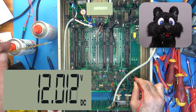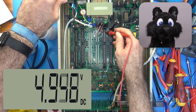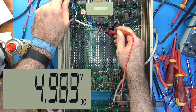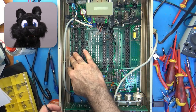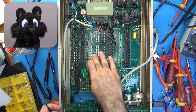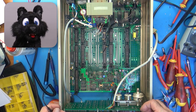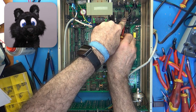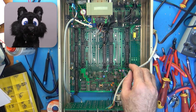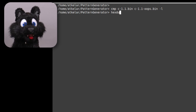Plus/minus 12 volts and 5 volts, as well as 6.1 volts. Good! Before I plug in any of the boards, I check if there's anything getting warm. Ow! That's not just warm — why is the EEPROM so hot? The notch is pointing that way! I see — oops! Good thing I saved the contents, because this one is definitely... still working fine? Whoa, they sure don't make them like this anymore!